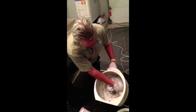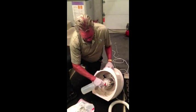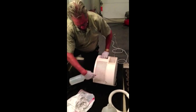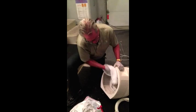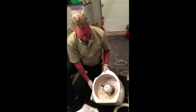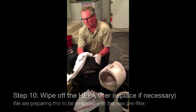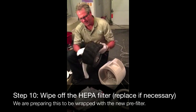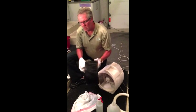This entire process is very important. I'm going to spray my antimicrobial sterile solution all through these little fins and these little openings, then take another rag and wipe the inside. The unit is now very spotless and clean, and ready for your new filter. We want to just gently wipe the HEPA filter off. Again, the light was not on, so we don't need to replace this — we're just going to put it back in with the new charcoal pre-filter.